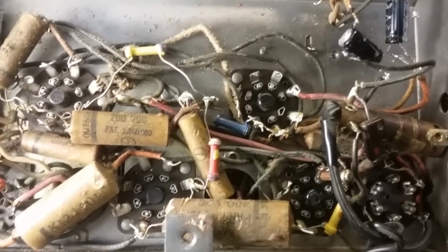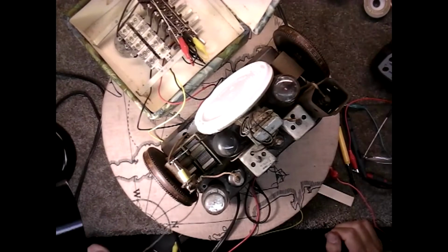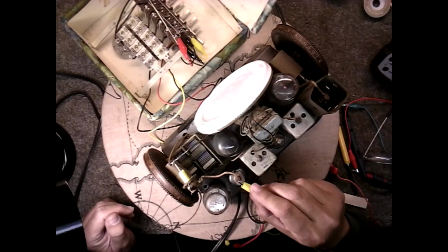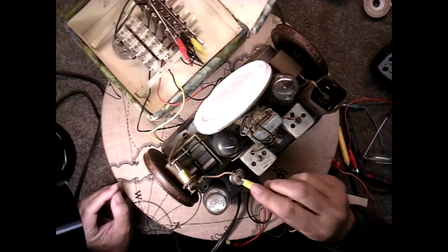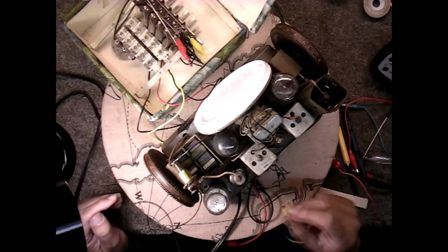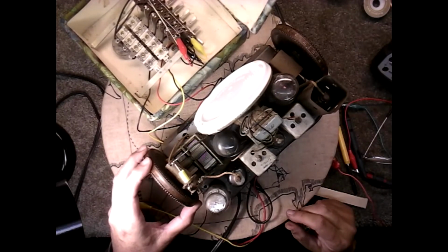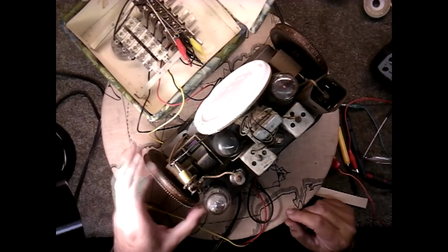So, I'll be back. Okay, this is Paul. I got this radio recapped, but it's got some other issues. When I feed a signal, I'm getting a signal through there. It was almost dead earlier, but I've been playing with it and I got it to respond a little better. And so that's fine. But when I go to the antenna, I'm getting nothing. And when I turn this, I'm getting, oh, there's a little bit there. But nothing. It's like this section here is dead.